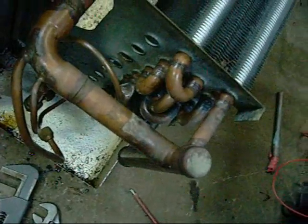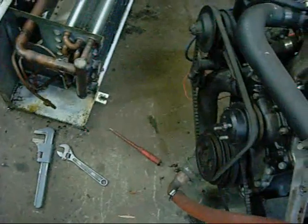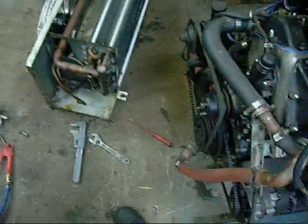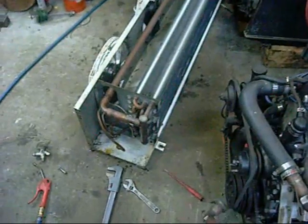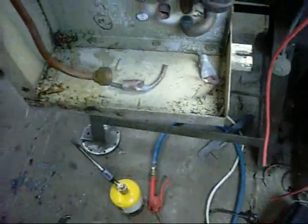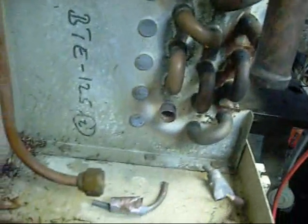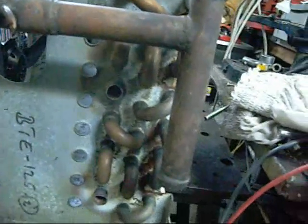I'll chop it up and see what I can de-solder. I've got to get a proper oxy-torch - those crimped ends are going to be a pain in the ass. But at least since I'm only running maybe 20 or 30 kPa of water pressure through it, I can just use lead solder if I have to - it won't hurt anything. Well, that was significantly easier compared with what I thought I'd have to do. Those things there are just inserts - you can just jam them in the hole and solder them in, so it's only a simple matter to de-solder it with a MAP torch.